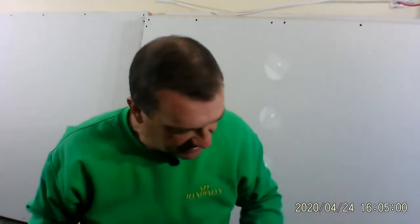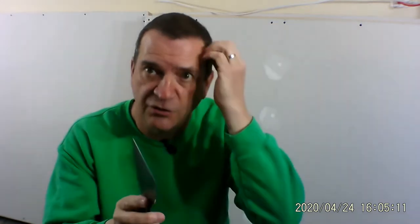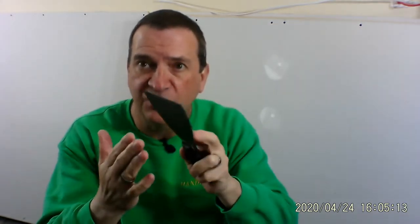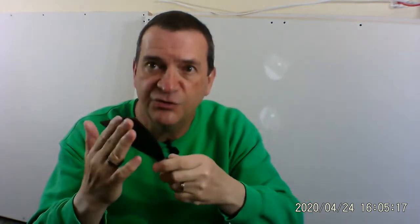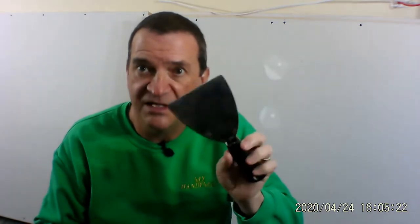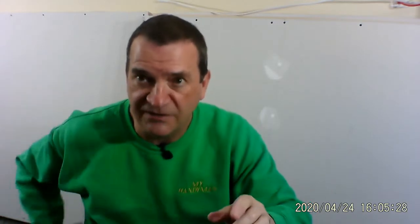Let's talk about knives. The knives that I use — this is my four-inch all-purpose knife. I use this one for almost everything: putting on a first coat of drywall mud, covering screws and holes with drywall mud as well. It's nice and small, compact, easy to use, and very rigid. That's my go-to knife for a lot of stuff.